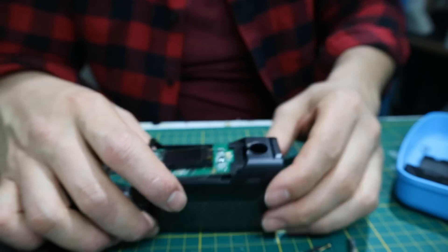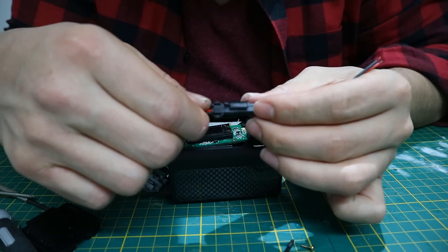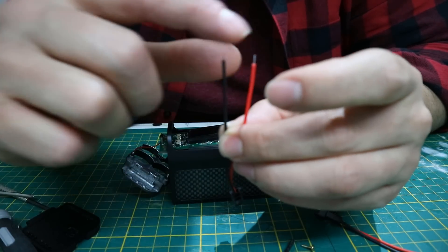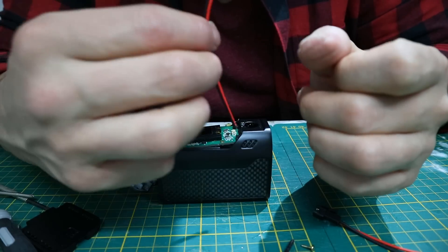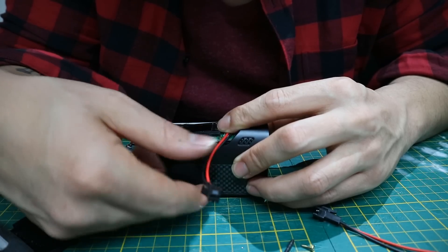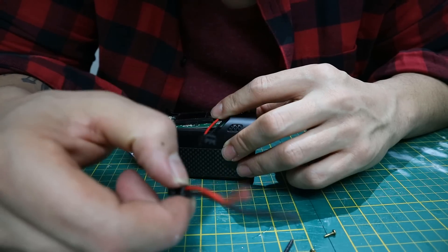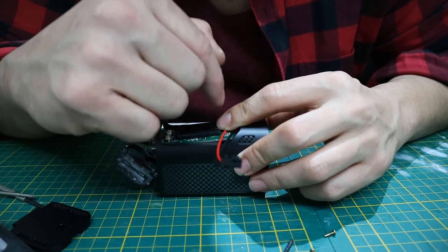I'm using one of these quick connect/disconnect snap-on connectors — I'll put a link in the description. I always use these, especially now, because they have two small pins that are already pre-soldered, perfect for these little soldering connection points. Once set, I'll super glue it and zip tie it shut so that any cable tension pulls the zip tie and not your connection point, since this is the most fragile part. If a switch breaks, I can quickly disconnect and replace it without messing with the soldering points.